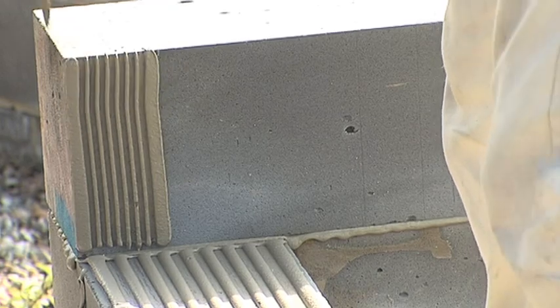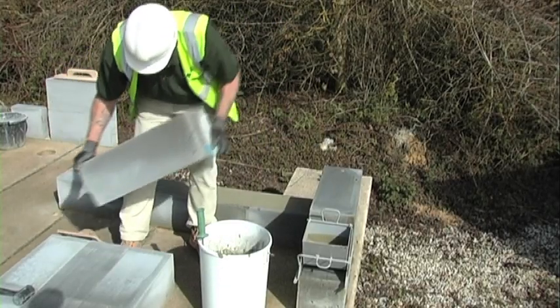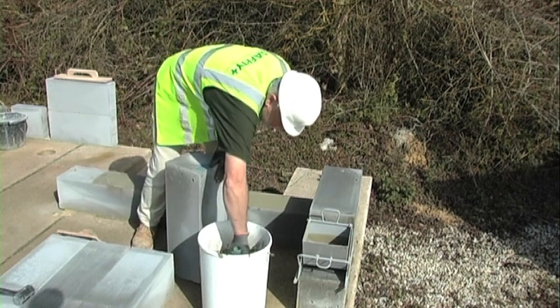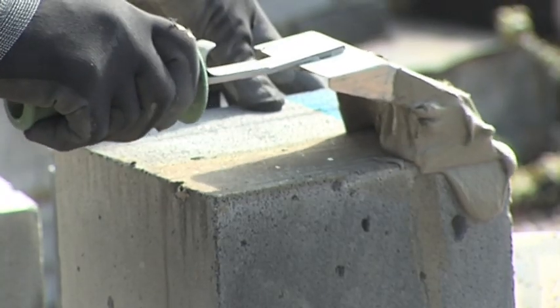As you can see I'm going down one side of the block with a scoop and I'm placing the other side of the perp on that side of the block. I'm a bit restricted as a guide is on the scoop itself. Push the perp joints up tight and drop into the bed joint.